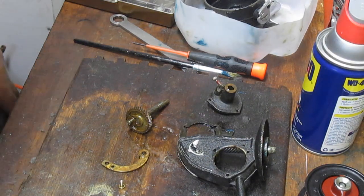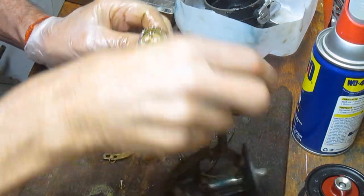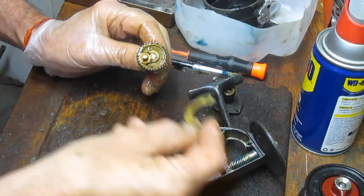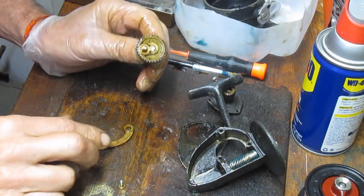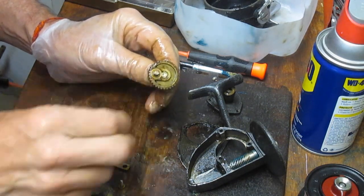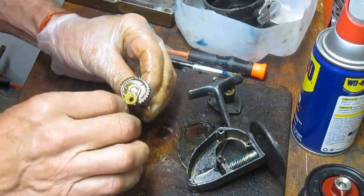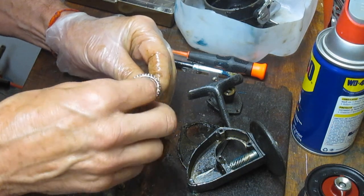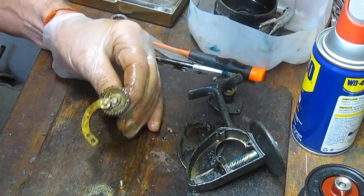We're back. In the interim I did take this off to clean it, and I remembered that when you change the drive hand you also have to change the orientation of the arm so it's properly set in the case. This one was set up for the other drive — you have to flip it to make it work properly. So flip the orientation; those two pieces belong up with the clip. There's a little catch lever and a c-clip that was holding it on.